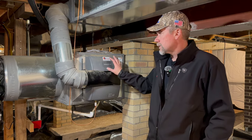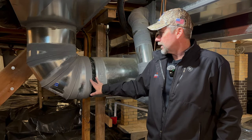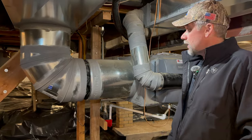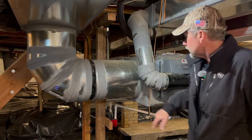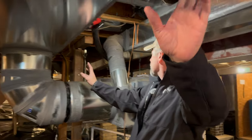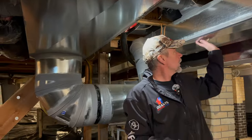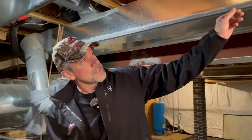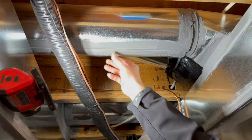Here we put in a duct isolator — you'd typically see this on the square side of a plenum on an upflow vertical system. It isolates any movement, allowing the air handler to move slightly, and helps prevent sound from traveling. This is one of our return ducts running in this direction. Here in Colorado, we seal all of our joints — you can see all sections have been sealed with duct sealant, including the headers.